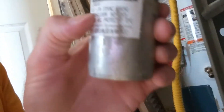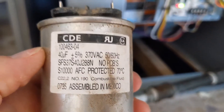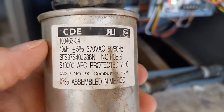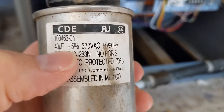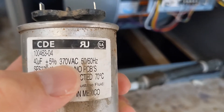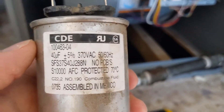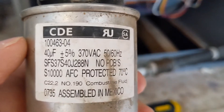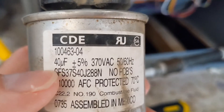Here's how to read it. On here you'll see a 40 UF. Here is the old capacitor — it's an HVAC fan capacitor, you can Google it or search on Amazon. This is a 40 UF. The plus or minus five percent I don't think is important from my research. The two things that are important are the UF and the voltage — VAC. This is 370. This one actually can go up to like 450. So you might see some on Amazon like 370 to 450 — that's okay. The voltage can be higher than the minimum, which is 370 on mine. The 40 UF though has to match, as far as I understand.